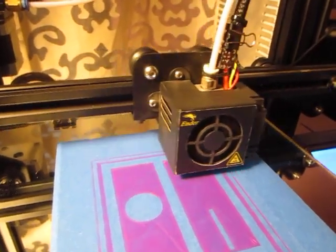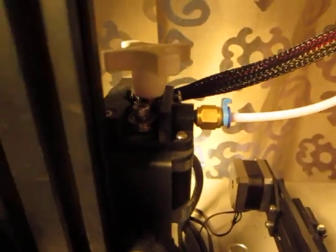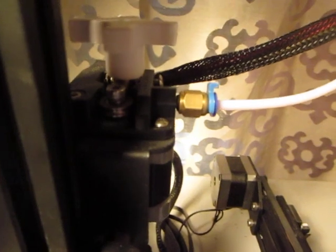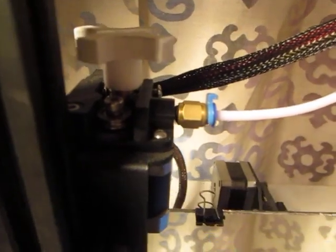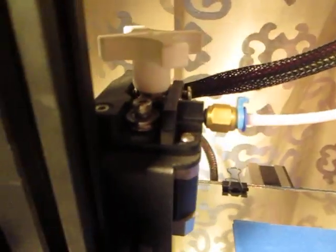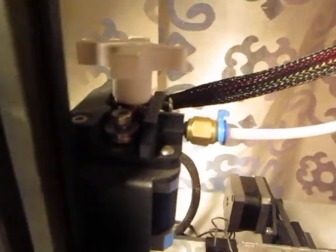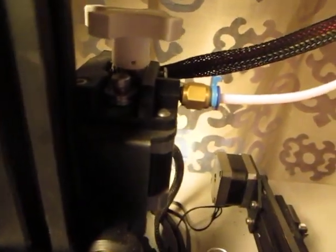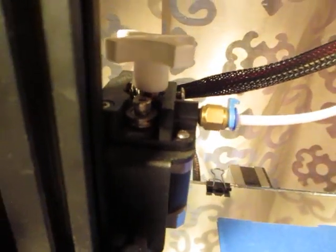This is the print head — the hot end. This here is the plastic extruder from Creality, the original body. All four of my printers including my CR-10S still have the original classic plastic extruder. If you ever have trouble with that little arm, that's the most likely thing to have to replace — it's about three bucks and five minutes. No e-step changes, no modifications of any sort to the extruder at all — same stepper motor, same everything, same gear.